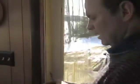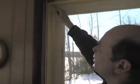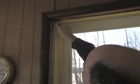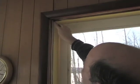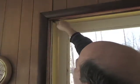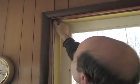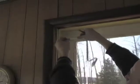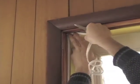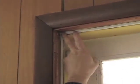Again, if I had a certain type of adhesive with me, every 3 inches I would put a dot of adhesive. Now in this situation, I want to miter or come in at an angle. So with my knife, I'll go ahead and simply saw off the piece of gasket material, making a 45-degree angle. Coming back in and overlapping slightly this gasket material, I can apply and put it in.